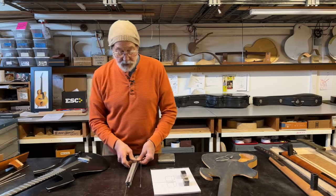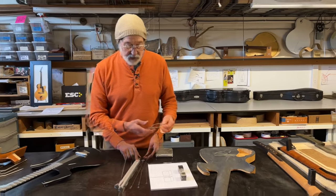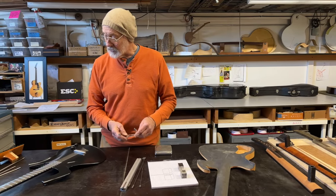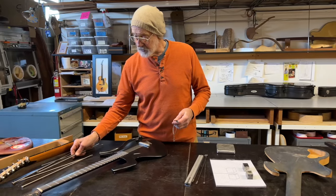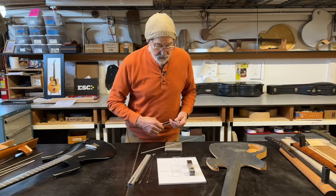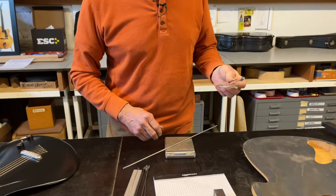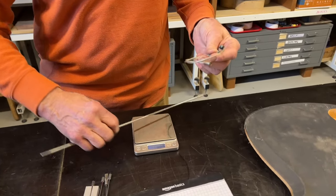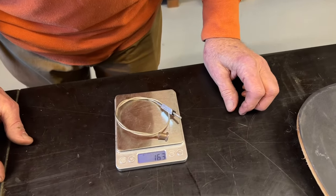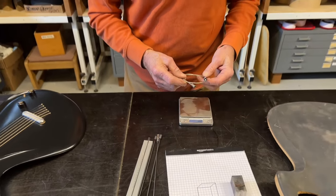In the mid-80s I started playing around with some other schemes — a simple compression rod. I wanted to get away from the weight of the double rod. The double rod would have been roughly 125 grams. And then this is a 1/16th-inch diameter cable — the engineering numbers tell us it's plenty strong enough to be a compression rod on a guitar. Look at this — it's about an eighth of the weight. That's a pretty striking weight reduction.